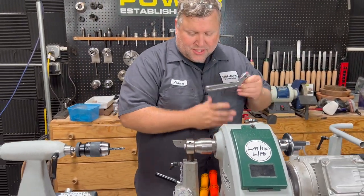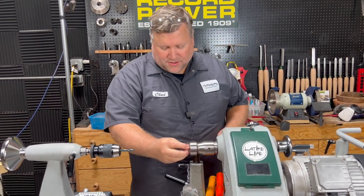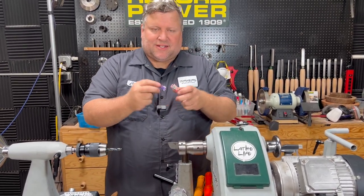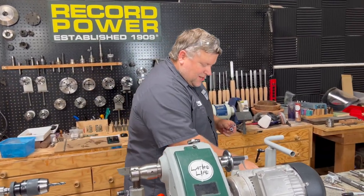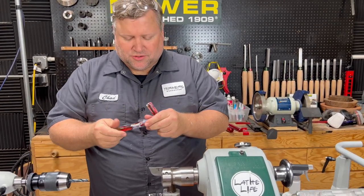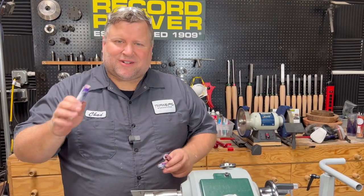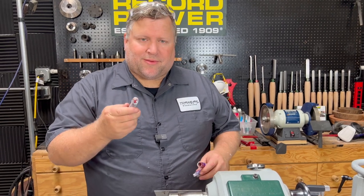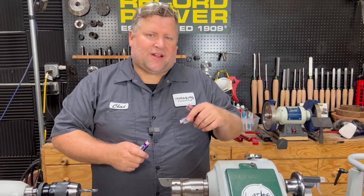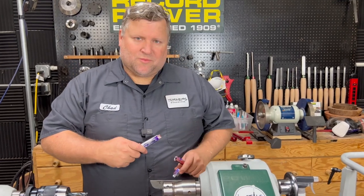It's nice to clean these parts when you're done. When we go to turn these parts, we're going to be putting them on mandrels, and we want all these threads — internal and external — clean. We can test fit it in the body, test fit the nib, and everything looks fine. So I'm going to put these in the ultrasonic cleaner. It's going to do two things: one, get all the WD-40 and other oils; and two, really vibrate any little dust particles that are down in the threads and in the body. Stuff just kind of pours out. So let's clean these, and then in our next video we'll shape everything, do a polish, and have a completed fountain pen.